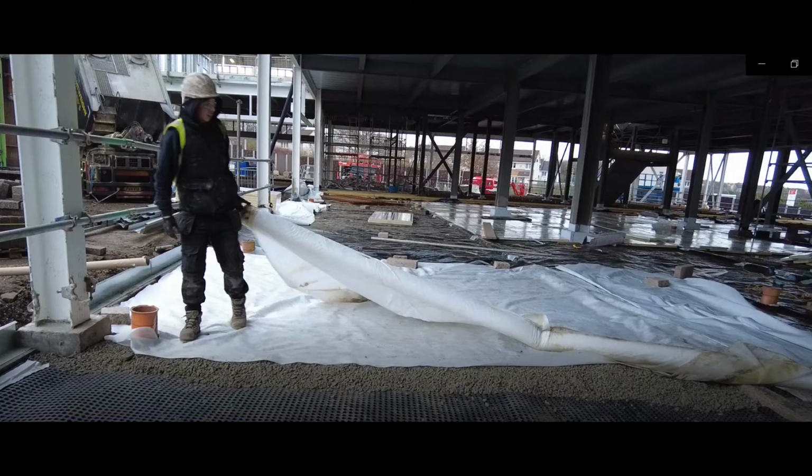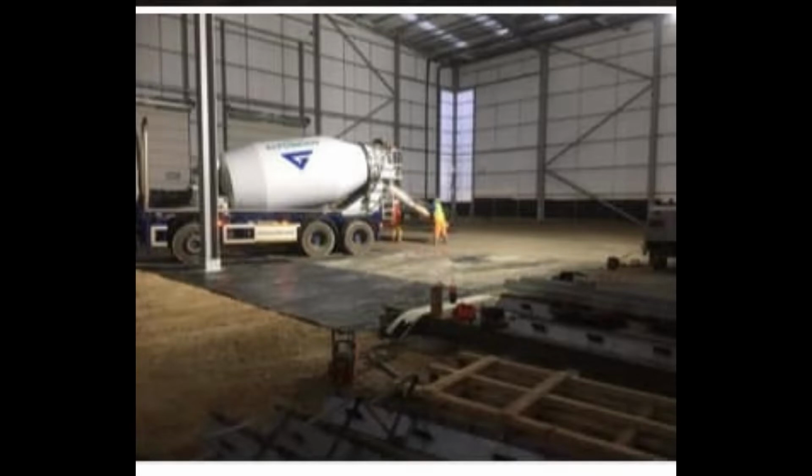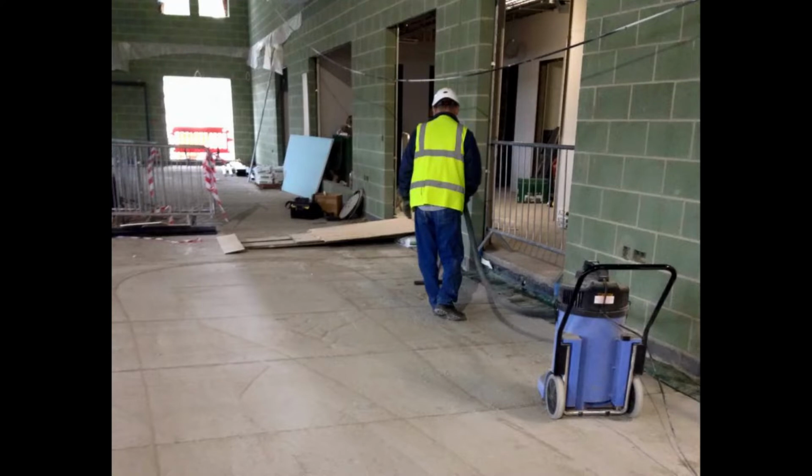Every cloud has a silver lining, and when you encounter environments where geotextiles have been designed in and are actually being used, and contractors are aware of the benefits of putting these protection measures in, it's really rewarding to see. Here we've got an example of a technician laying some geotextile prior to putting the membranes in. Really good. I don't think we need to see any more horror stories. Here's another lorry driving on the membrane, just for good measure. No, please, let's move on.